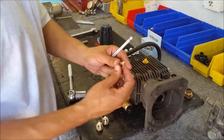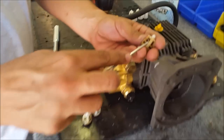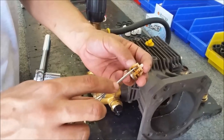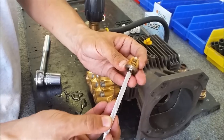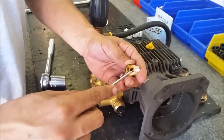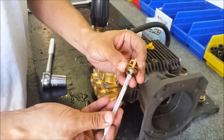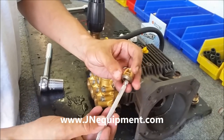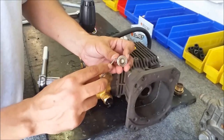Once I've got the top valves out, one thing I like to do is inspect the valves. A lot of times I find debris trapped in the spring, and sometimes that debris will stop the spring from being able to open and close the valve seat — it's really important that it's able to do so. If you find any debris, obviously you want to clear that out, and it is important to check that the seats are clear.